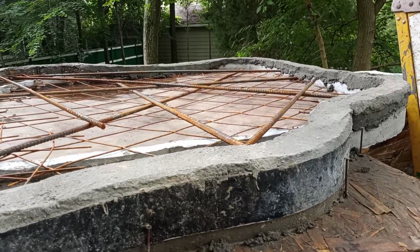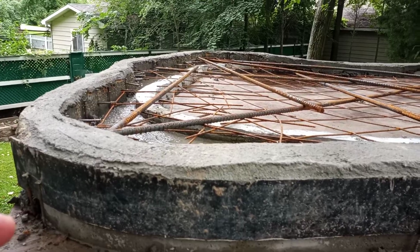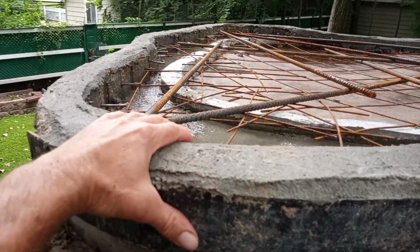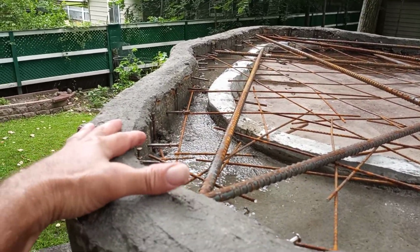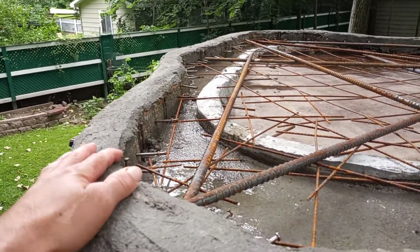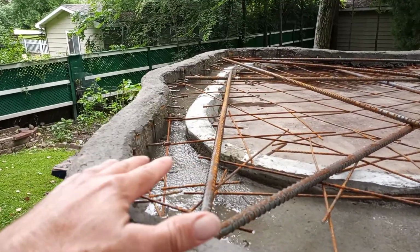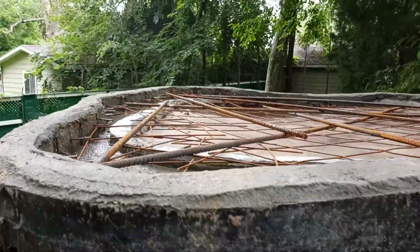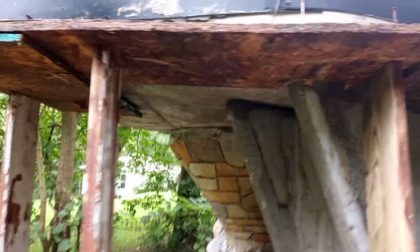I don't use just regular concrete. I put additives, like I said, the fiber mesh. I put the polymers in there. This part here is 100% bonding agent polymer in these mixes here because they're so important. Used no water. There's water to make that polymer and bonding agent, but very expensive mix, but very strategic what's going on with these overhangs. So basically, I'm making a concrete form is what I did in the prior pours. And you can see it's a pretty good cantilever that's happening here.